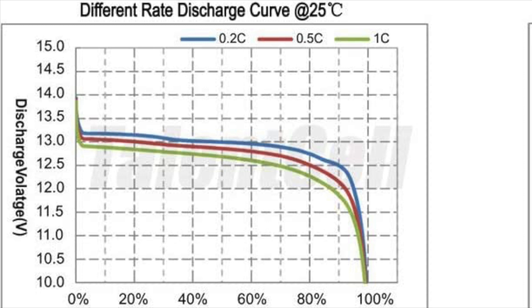The lithium iron phosphate voltage ranges from about 13.5 volts down to around 12, and fully discharged around 11.5 volts. This means you have a much more stable output. If you're using a Raspberry Pi on an ASI Air or something like that, I think this is the safer option. I do not know the bottom input voltage that the ASI Air can take because it just says 12 volts nominally, but I do know that it can run at 11.5 volts because I see it in the chart all the time.